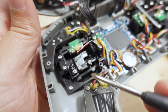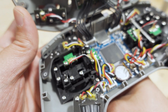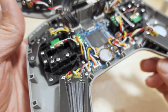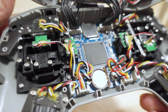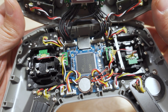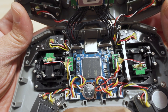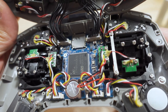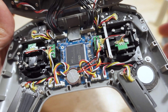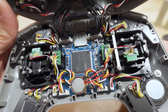There's a spring tension screw there and also one there on the elevator and aileron side - roll and pitch. Those are the screws for adjustment. This looks, if I'm not mistaken, pretty much the same as the T12 and T-Light gimbals - they haven't changed in their design, size, or feel, although I think this thinner wire might be new. I'm not 100% sure about that - if you guys know, let me know in the comments.